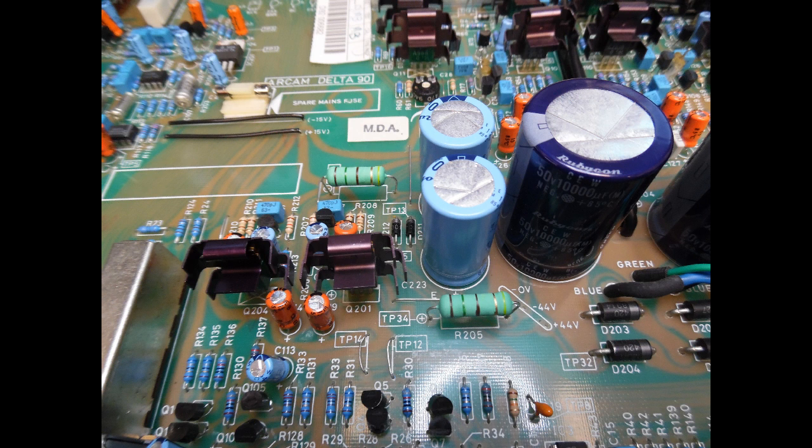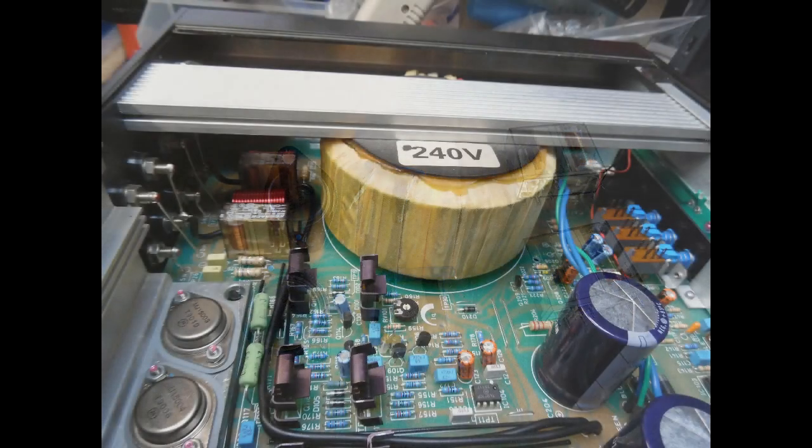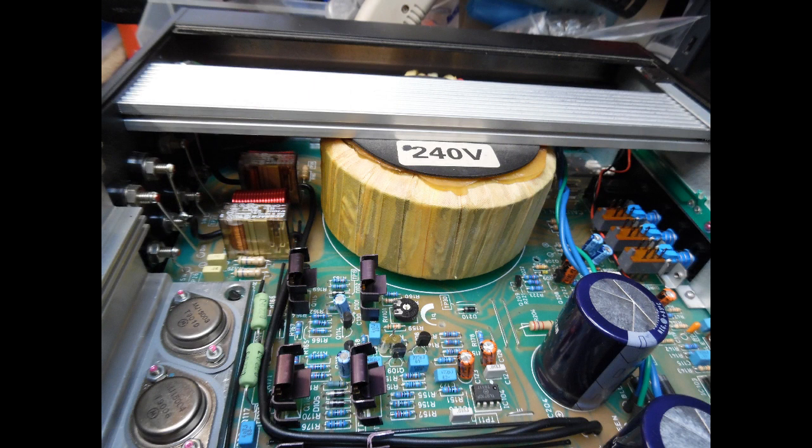Because this is quite an old amplifier, I also replaced the protection relays — there are two on board. They are 48-volt, single-pole changeover relays with a contact rating of 16 amps, which is very high. That's because as a single-pole changeover it's effectively two 8-amp switching contacts in one, giving a higher rating. This replacement avoids future intermittent noise, distortion, or intermittent loss of sound.